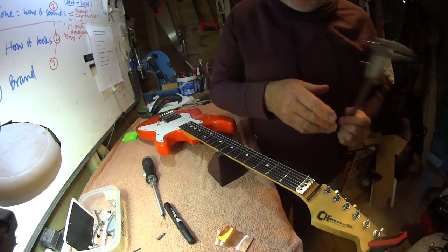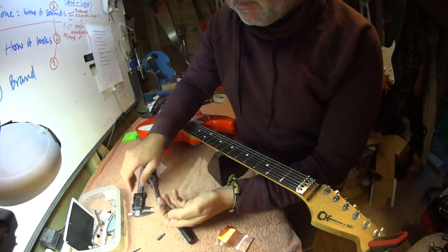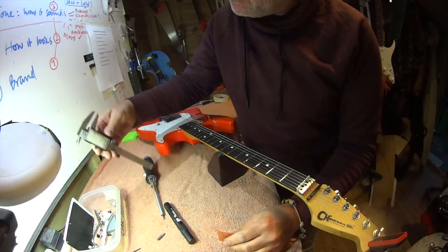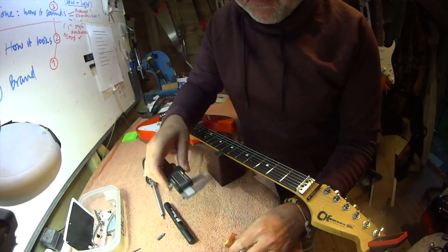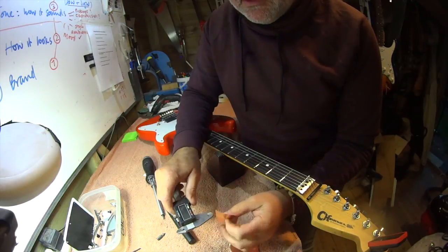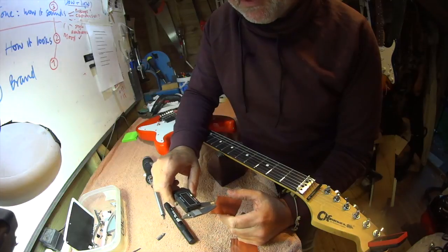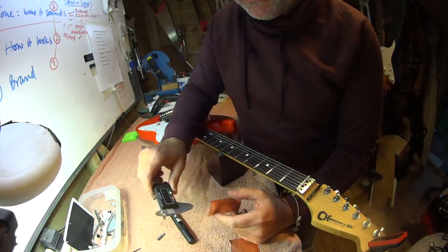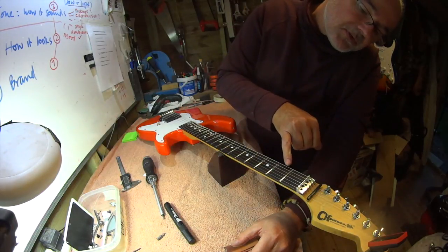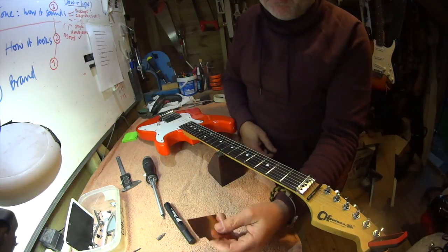And actually, I'll tell you what. Oh, that's where one of three of those went. Thank you. Bizarre, something magnetic here then. So yeah, what we've got is a shim of, wow, a tenth of a millimeter. Which is quite neat, because if that's 0.1, then this will then be 0.2, 0.3 and so on, so we can go up in chunks.